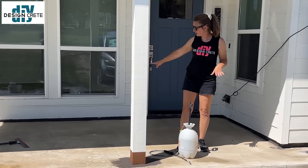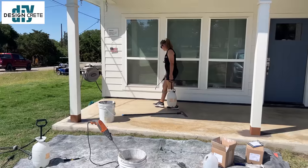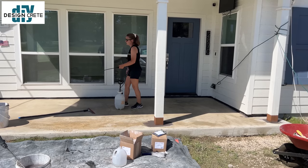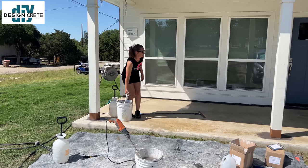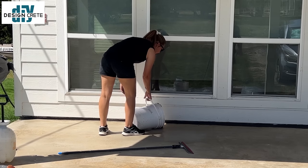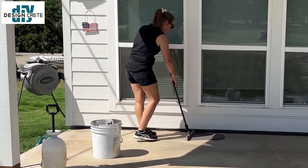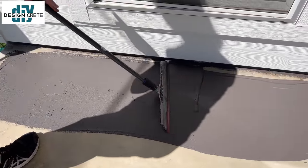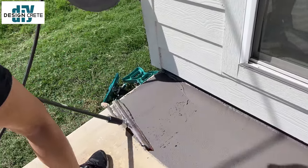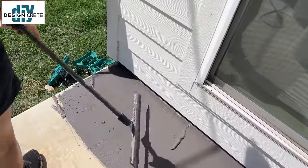I've cut in all the verticals around all the poles, and you can see the concrete's already drying up, so I'm going to spray some more water and then we'll spread it out. The wood grain on this patio is going to go this way, so I'll be spreading out my base coat wall to wall in the direction of the grain. Start with a small puddle and spread it out — if you pour out too much it'll be hard to work with. Grab your magic trowel and spread it very thin all the way up to the wall.